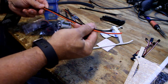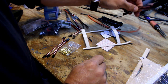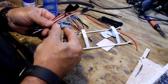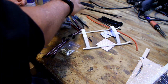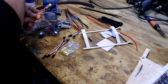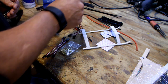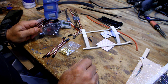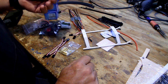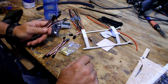You're going to get wire — you'll need a foot of 14 gauge wire on the red and black. You'll need 4 inch zip ties, 8 inch zip ties, and four extensions. I've ordered some longer extensions but we'll see how it goes. With the new design, these speed controllers are so small we're leaving them on the arm, which takes out all that soldering. These speed controllers weigh 10 grams compared to 30 grams for the old ones — so that's 60 grams saved, approximately 2 ounces just from speed controllers. The frame is a couple ounces lighter too.